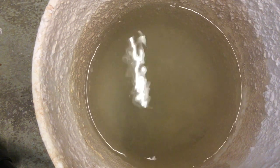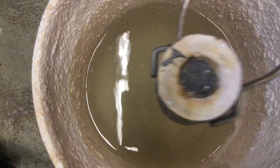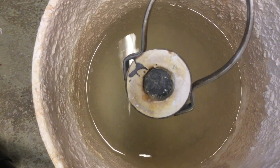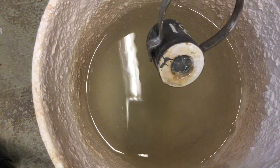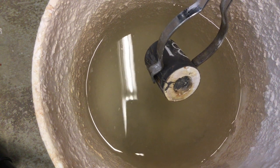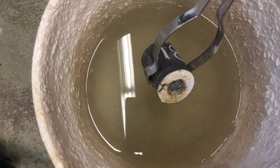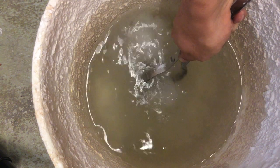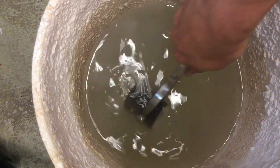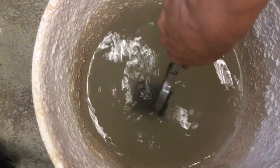At this point our piece is ready to quench. You've got a whole bunch of silica at maybe a thousand degrees and you need to get it cold. You don't want to breathe any of the dust, so we're going to quench it under water and wave it back and forth as the heat from the plaster forces everything to erupt — it looks like you're just sticking a flask into a bucket, but if you do it right your piece should come out without much effort.